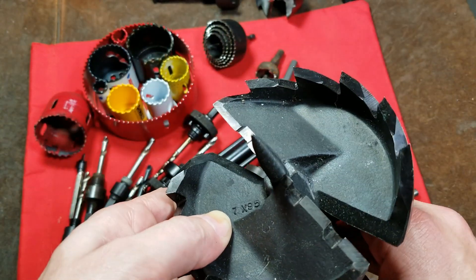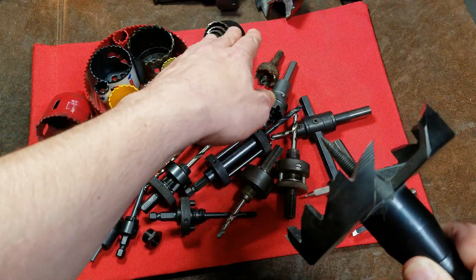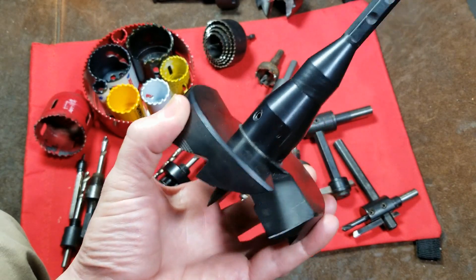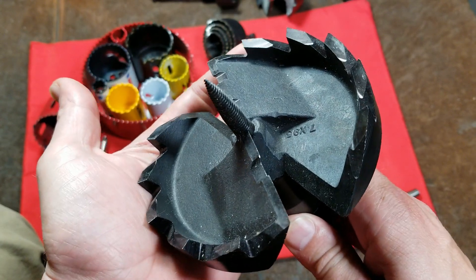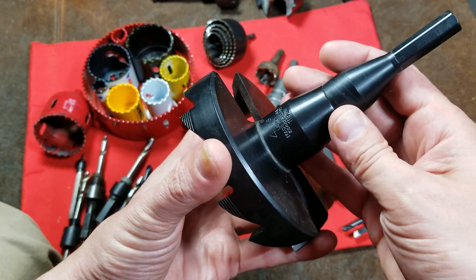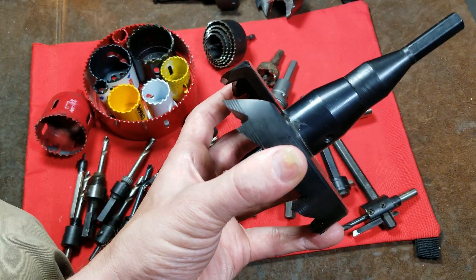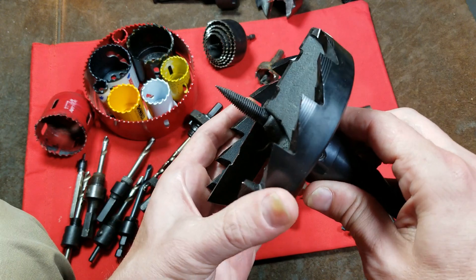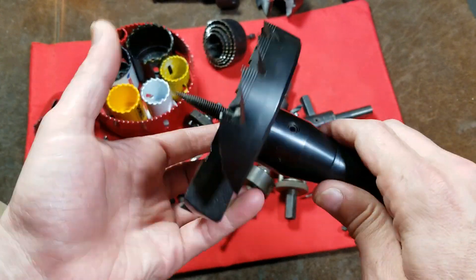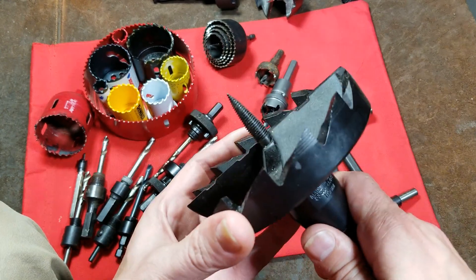When self-feed bits get really large, they'll have two chip lifters and even interleaving notches, such as this Lennox. This is a four and five-eighths self-feed bit, used by plumbers for lavatory or toilet drains. These are notorious for requiring huge drills and lots of power. However, the newest brushless corded or cordless drills have been shown to drive this four and five-eighths self-feed bit through softer materials like Douglas fir. This is a really big cutter — around $65 — so much more expensive than a hole saw, but really meant to go the distance.